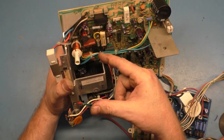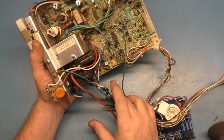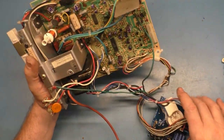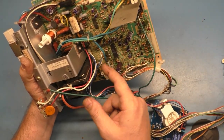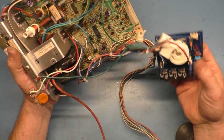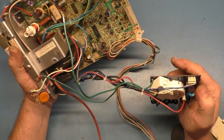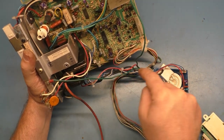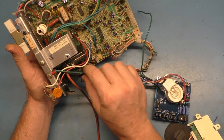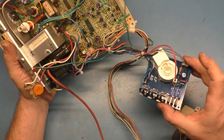C69 and C36 installed. I got the horizontal hold pot replaced. I got the remote board installed. I got the missing harness and connector for both sides installed. I got that from a donor K7000A, so the harnesses are installed for both of the connectors. I robbed a connector for here and a connector for here and the harness, and got everything installed and wired up. And I got the ground wires installed that run to the DAG and to the frame here. Everything is now done and we're actually ready for testing on this.